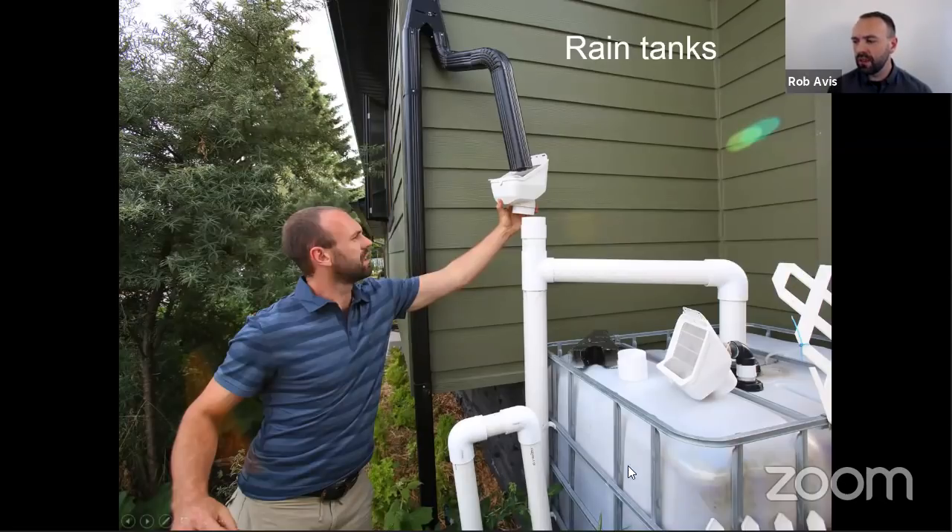The water goes into that swale all winter long and sub-irrigates the food forest. The pipe is built into a level ditch, embedded with wood mulch. That wood mulch receives the water, absorbs it, becomes a sponge and a living fungal mass, creating water storage, fungal habitat, and a place to send surplus water without losing it off the property. Now except for one small space on my yard, we absorb all the water that falls on our property. If everybody in the city did that, there would be no stormwater issues.